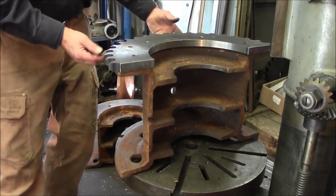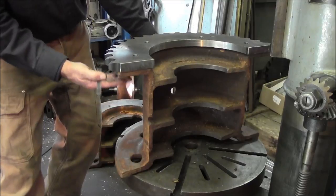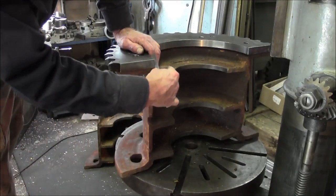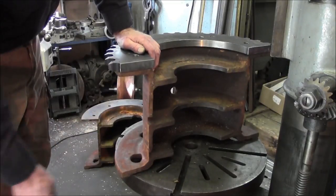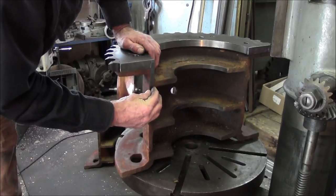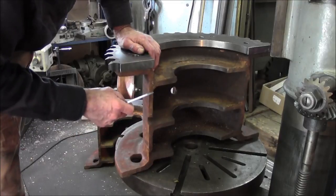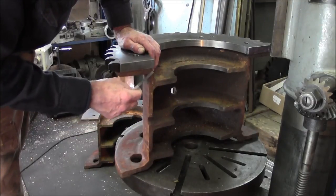All right, we just tried to take this gear, or the sprocket, which is actually going to ride on this bottom side here. We tried to slip it underneath there, and of course this inside radius was made to turn for the other pair of laggings. This pair of laggings is about 1/2 inch larger on this cable wrap diameter than the original laggings we built these for.